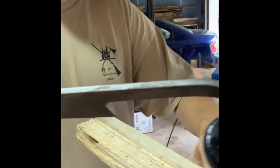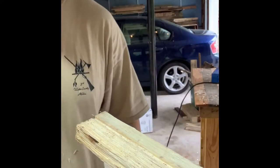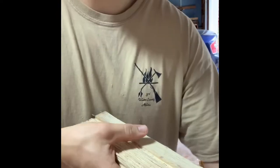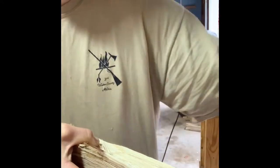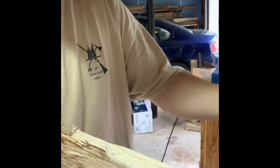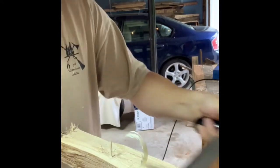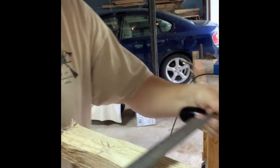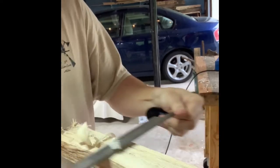So what I might do - I got that down pretty flat, it's got a good gap right in here. I have a hand plane, and once I have a joiner I might run it through once I get this other side in, because you can see I've done this side. Now I got to get that one off. But it's all about patience. I've rushed a lot of stuff and it never does any good to rush. Take big chunks off when you can, but eventually it gets down to the fine work. It's not always my favorite part - I kind of like to take big chunks out, it's my nature.